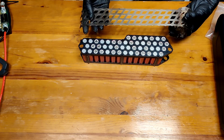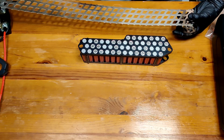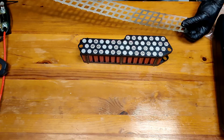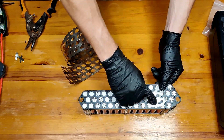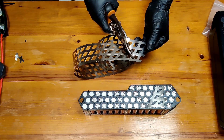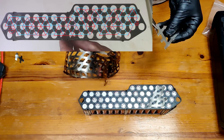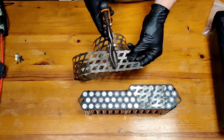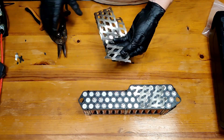This is the amount of nickel strips we have to work with that came with our kit. Now we can start cutting up the nickel strips following our diagram — this makes it pretty easy to go through all the connections and cut the nickel strips to the size we want. Basically we are trying to mimic each of the colors on each of the sides with a nickel strip.